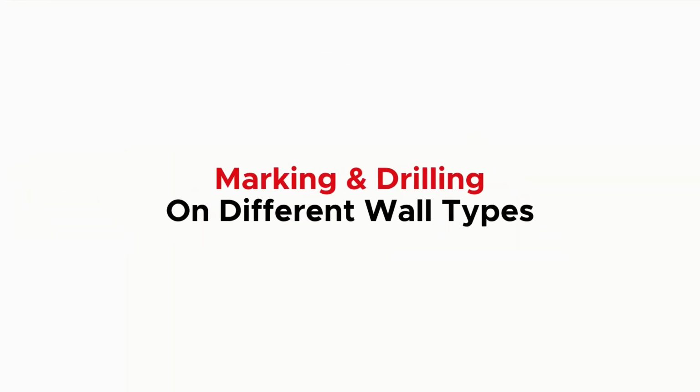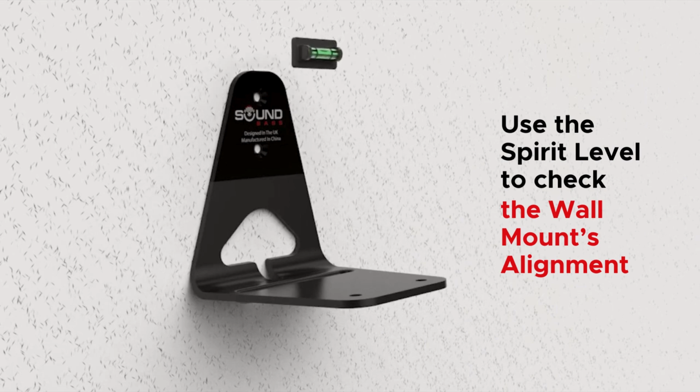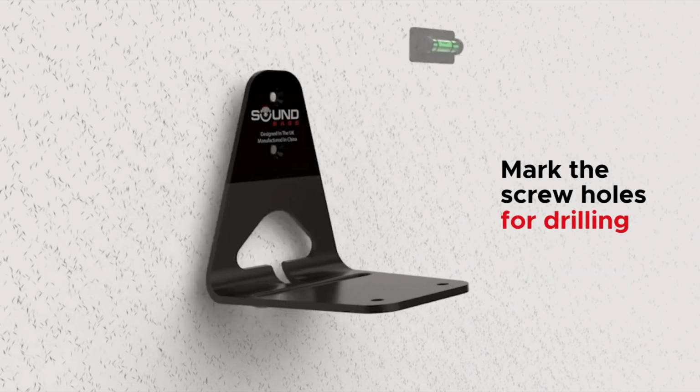Now let me explain how to mark and drill on different wall types. Start by using the spirit level to check the wall mount's alignment. Then mark the screw holes as preparation for drilling.